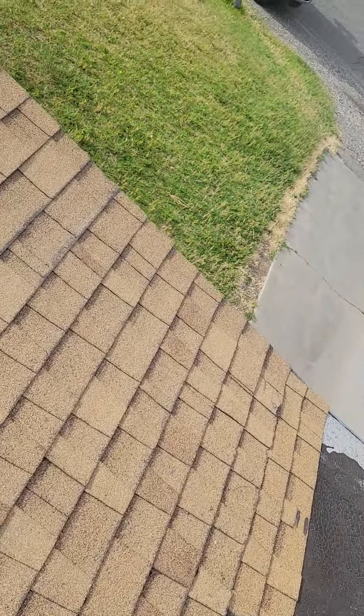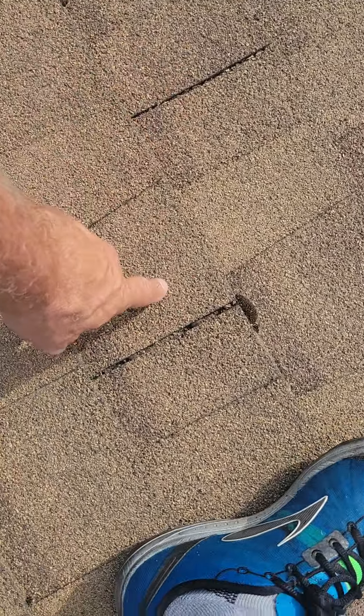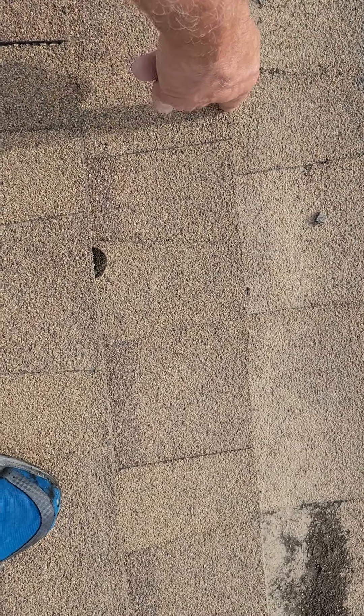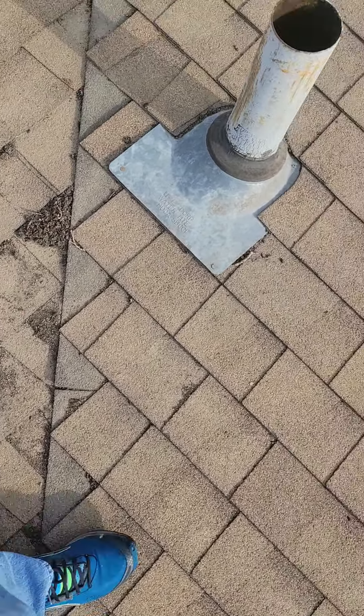I'll walk this off. You've got to do this right one time. The roof and the foundation are the most important things on this home because you're ruining your home — it's being ruined. No more Mickey Mouse stuff. You're not taking up two roofs, you're taking up this one. When you roof, these are common joints, but these are too close — you need to move them farther apart. This is going to go down into the shadow more, moved down. You're going to use more roofing, but your overlap is going to be larger. It's more difficult, but you've got to do it.